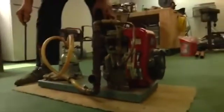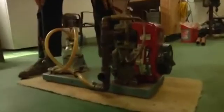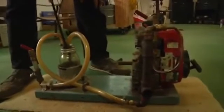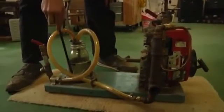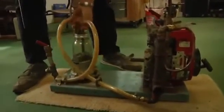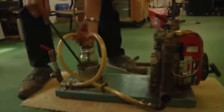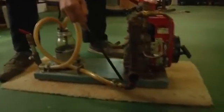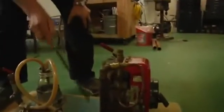Through the center of this is another pipe going all the way down that starts out over here being fresh air, with this valve allowing fresh air to bubble down the center of the bubbler all the way to the bottom. It bubbles through the liquid you have in the bottom. It then pulls the vapor off the top, feeding it up the center of this line, the center of the exhaust pipe in the opposite direction of the exhaust.